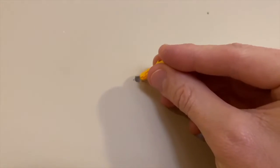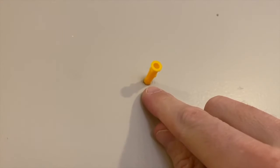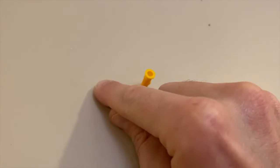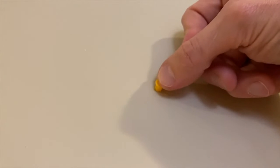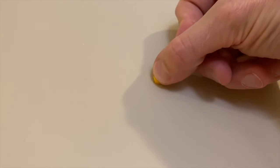Back to the wall, and again, it should slide right in. The last thing you want is to hammer this in aggressively to a point where you end up cracking or bending your drywall. That would not be good. Again, just carefully slide this in place, and that screw is going to help expand it and help this drywall anchor grab the inner drywall and lock in place. And go ahead and push it flush with the wall itself, as shown here.